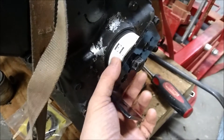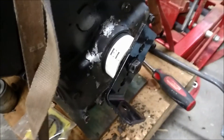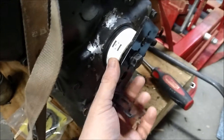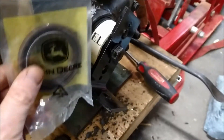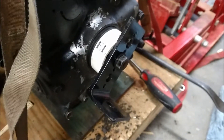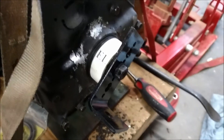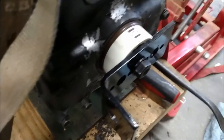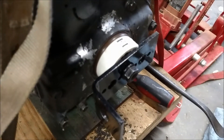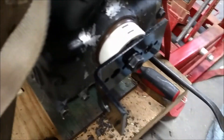You don't have to worry about getting the seal crooked or banging on the engine. I just tested it out with the old seal, so we'll get the new seal swapped in and tighten it down with a socket. Before I set this up, I did make sure to sand the end of the PVC pipe flat and smooth so I don't have to worry about cutting or damaging that rubber seal.